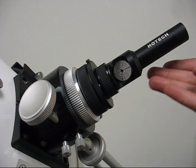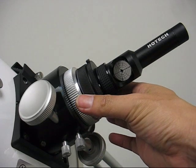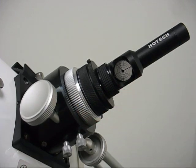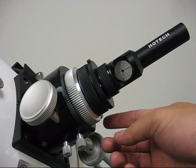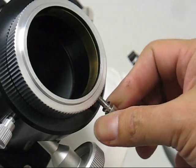It is very important for a laser collimator to be accurately and firmly loaded in the focuser, because the laser is extremely sensitive to any misalignment. Any minute locking error from the thumbscrew or focuser locking mechanism to the collimator will be revealed.